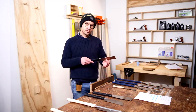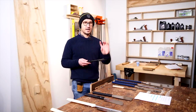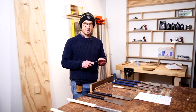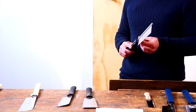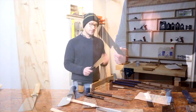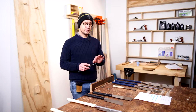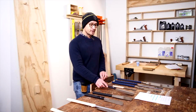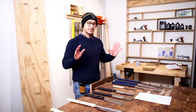With a saw that's pushing through the cut, the metal between the cut and your hand is being compressed and will buckle and bend. And so you need to make a blade that's a lot thicker to resist that buckling movement. A thick blade is not as good as a thin blade for slicing stuff. If you've ever tried to slice a pumpkin with a hammer, you'll know that it doesn't work. You need something very thin, and same with wood. So a thin blade leaves a thin kerf. It takes less effort to make the same cut, and it's less wasteful. You don't get so much sawdust everywhere. I hope that makes sense.